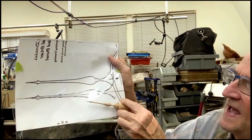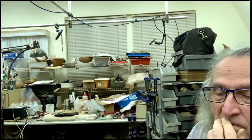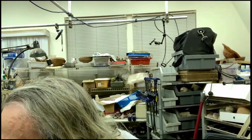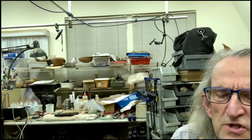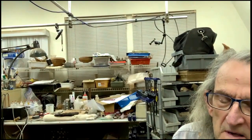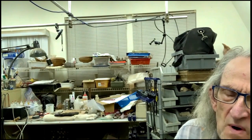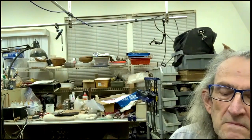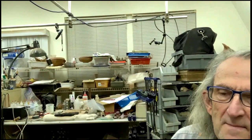It's a difference in proportion — it's about two and a half times the difference of what I actually turned. You're reducing it down to size. Can you go the opposite way and enlarge it? Sure, you can do anything. Now, by having a bigger pattern than what I'm cutting, that means I can be more precise — an error is reduced by whatever factor I'm at of the scale. If it was the other way, the error would be magnified instead of reduced.